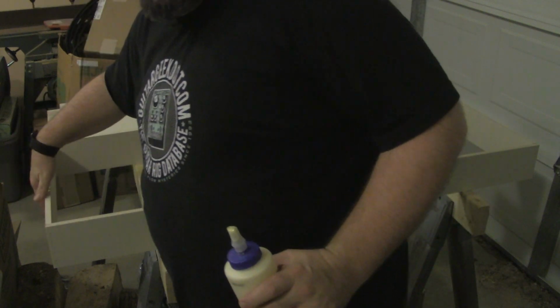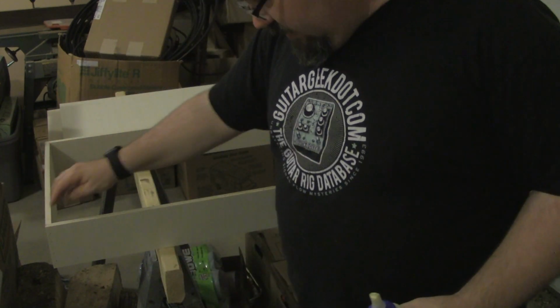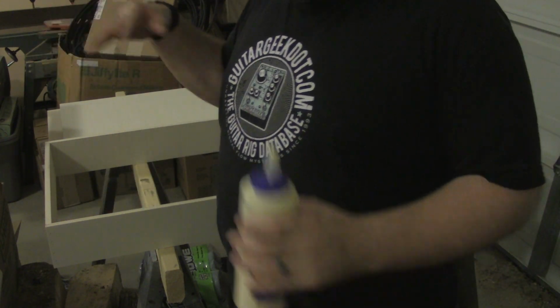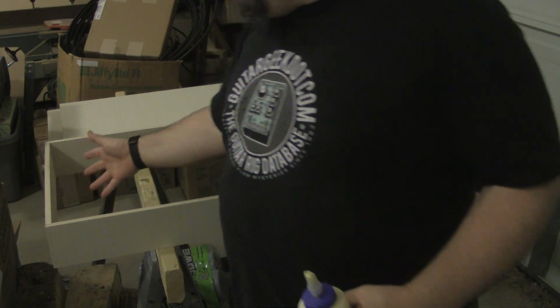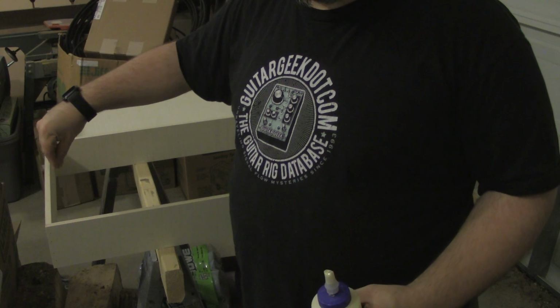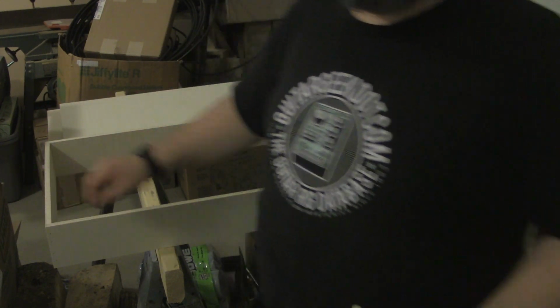Okay? So as long as I've got two sides, one side on each, that is perfect, those will mate up just fine. Probably what I'll end up doing, because the bottom side will be open, is once I get these leveled and together, I'll come in with a couple of lag screws, probably 4 or 6, and shoot those straight through into the other one, and it will pull those two modules together tight. And getting that top surface nice and tight, that's a big deal.